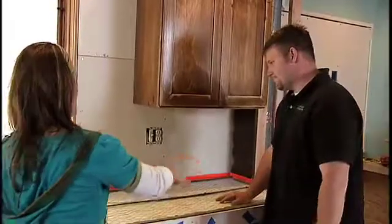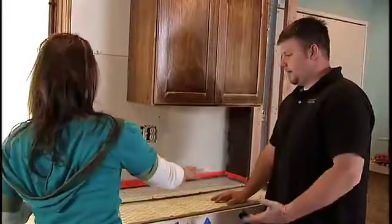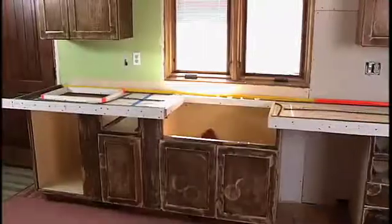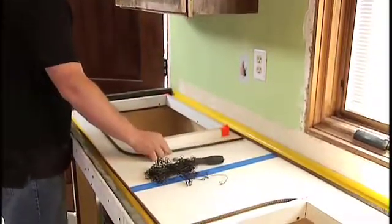Talk about when somebody's doing a concrete countertop, what are the most important stress points? Do we have to have more reinforcement in certain places? Yeah, like this is a sink cutout, and then there's narrow amounts of concrete here, and that's a 90 degrees. So a 90-degree creates a stress point there. Okay. So we bent a 90-degree piece of rebar to help hold that together.